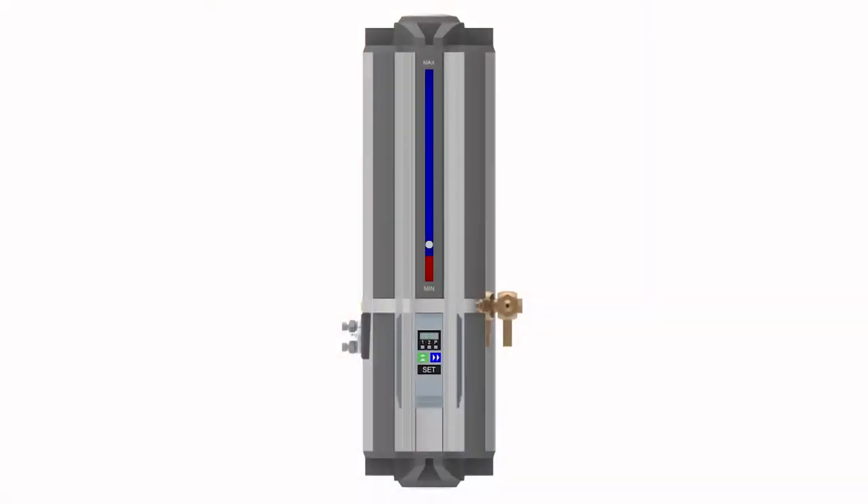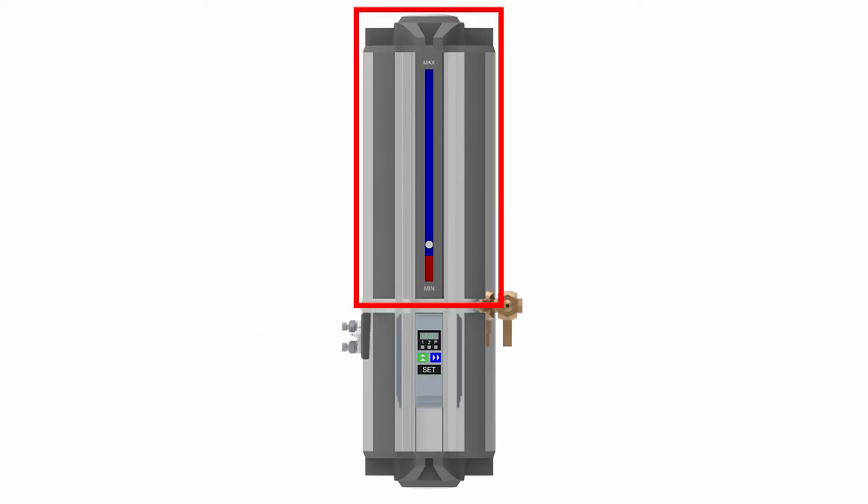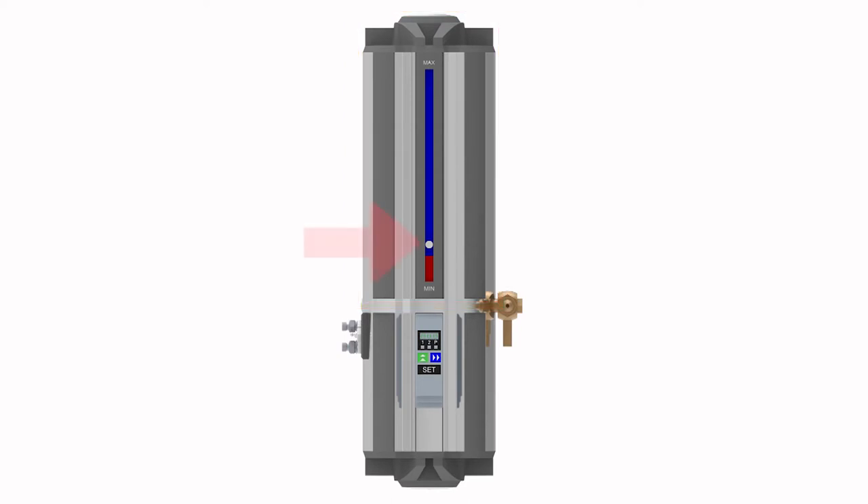The control unit is responsible for storing and pumping the grease. The top portion of the control unit, above the separation plate, is the grease reservoir. This indicator provides a quick visual on the level of grease in the reservoir. The bottom portion, below the separation plate, is where the pump and valving are located. Grease exits the control unit via two outlet ports, which are located at the separation plate on the left side of the unit.